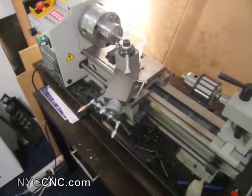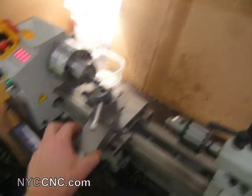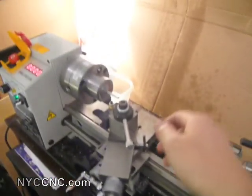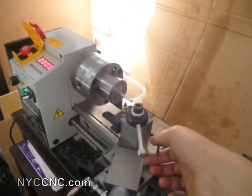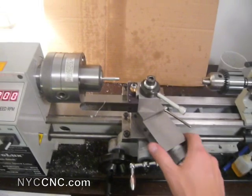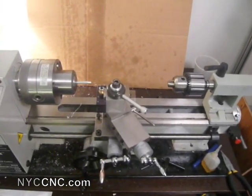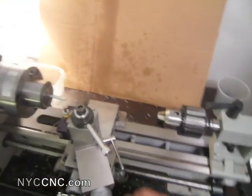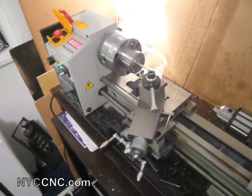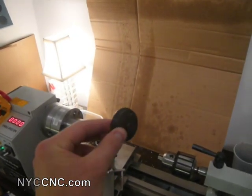I finished it the other night and it worked great. So without further ado, let me just show you. You lift this lever up here, and as you raise it you have full functionality to rotate the compound in any direction you want. Then when you pull this back down, it locks into place. I've spent some time turning with it now that I've finished it — it does not budge, it does not seem to be any source of chatter or weak point. Even though it's a fundamentally different mechanism of locking, I do have a picture here showing the inside piece which is replaced — the piece that comes with your lathe — this guy right here — you'll no longer need.